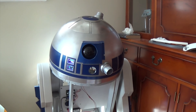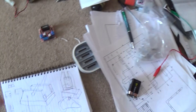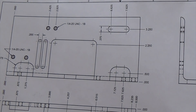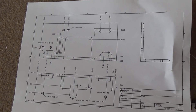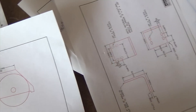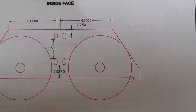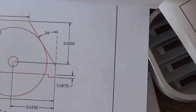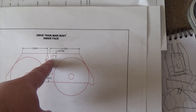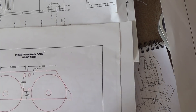We're getting there, though it's in a very messy stage at the moment. I'm trying to figure out what to do for the feet — just make some temporary ones while I sort through the drawings. There are a couple of different designs: the more commonly used one has one drive wheel and one caster, but then there's the Senna drivetrain which I kind of like — basically two wheels in each foot, both driven, with the motor in the middle. It's effectively four-wheel drive: a sprocket for the motor with a chain going around both wheels and back up. Just some of the many things I'm considering.